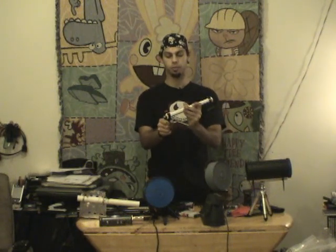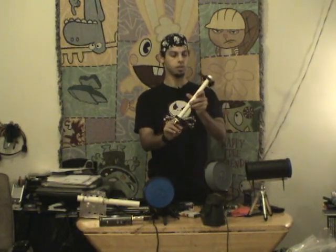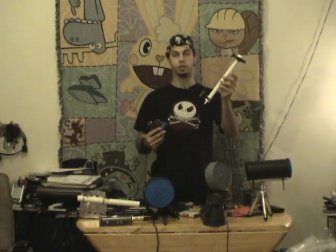So I can actually put this suction cupped to the side of the window of a vehicle, or even a moving train if need be, and then wire this directly into my Wi-Fi card to go and get a signal report. Now, again, the bi-quad is my favorite of all antennas, but you might want to fool around with the waveguide on this one.